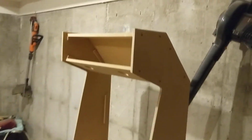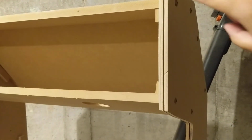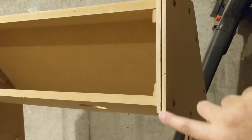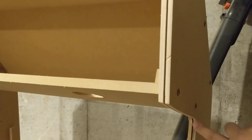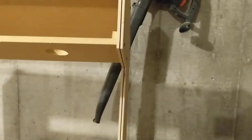But I was poking around online. It kind of brings me to this. I did add this right here. It's a focus. All right, so there's a T-mold that goes in this. It's like this curved plastic thing that'll go over the edge here, and it's 5/8 wide because this is 5/8 thick. And there's a little notch that you stick in there, and you tap it in with a mallet. And all the arcades have them. It's actually pretty common with arcades.